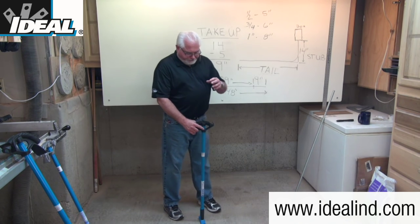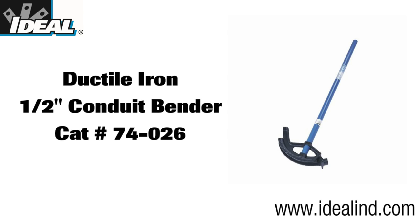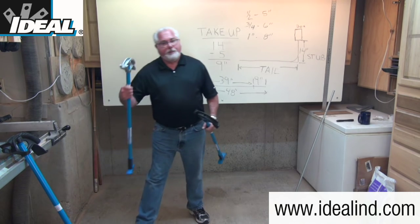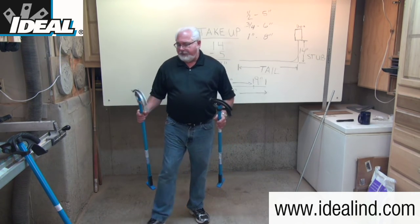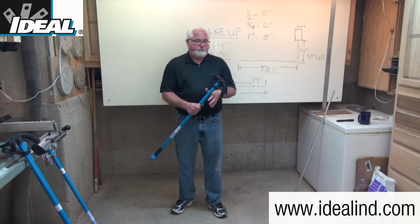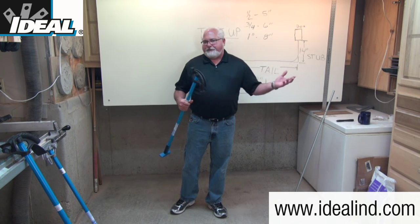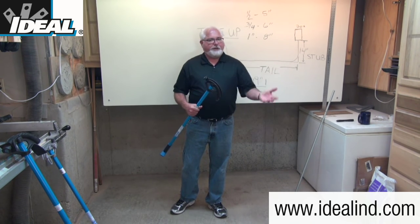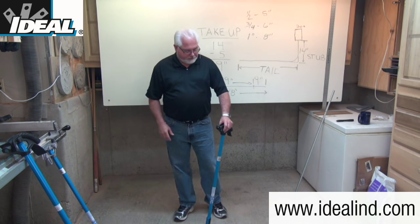In this case, I'm going to use Ideal's catalog number 74-026, our ductile iron conduit bender, but you can also get them in aluminum. The aluminum is a little lighter weight, which is fine if you're bending half-inch EMT all day, but if you occasionally need to bend rigid pipe, you'll want a ductile iron one. Cast iron is a fairly brittle metal, but ductile iron is a great product for this application because of its impact and fatigue resistance.